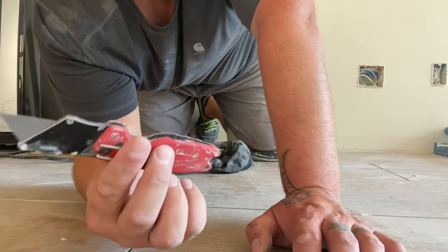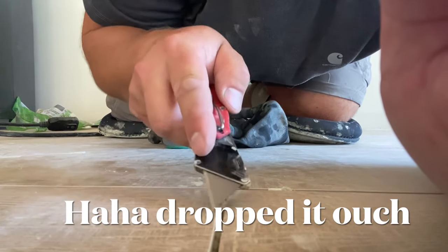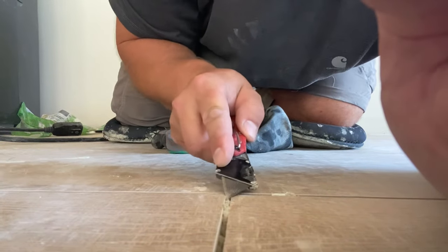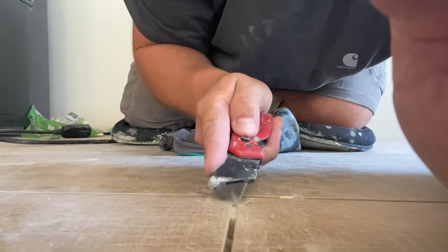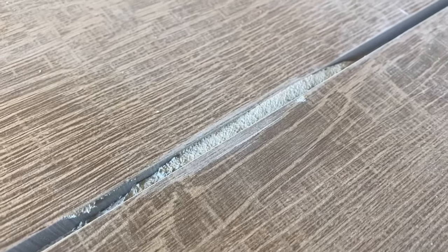So what I like to use — because you always have your knife on you — to clean these grout lines: you place it like this, take the blade flat like this. See how it makes a little corner? So you come across right here, start down here, flip it. That spot right there is down a quarter inch, now ready to receive some grout.